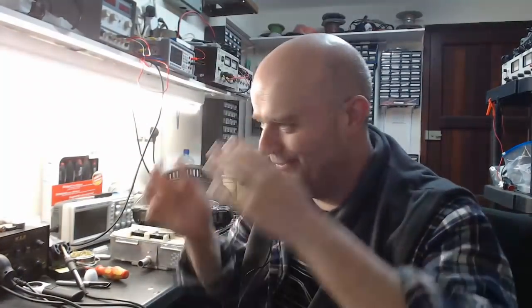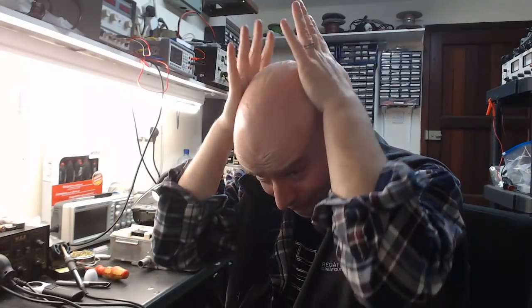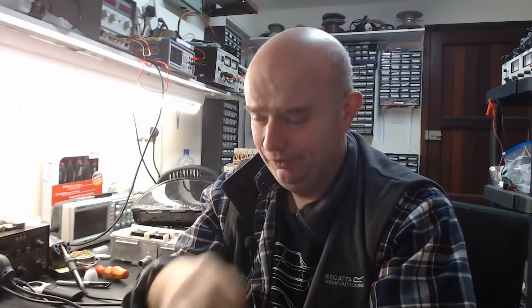Yes, split the Tesla motor and put it on the gearbox. How am I cooling the Tesla charger with coolant? Basically just got a cooling circuit going around between the inverter, the motor, the charger, with a coolant pump. I've repurposed an E39 transmission cooler for a radiator, and it's working quite well. I've got to put a fan on it for when I'm charging because the charger makes quite a bit of heat. But when we're driving, we don't need to worry about the heat because we've got ram air coming in through the vents, going through the rad, cooling us all down. So it's only when we're charging and the vehicle is stopped that we have a heat issue. So got to work on that.